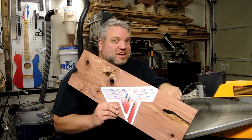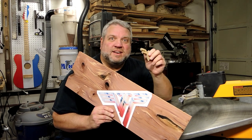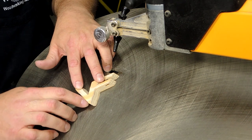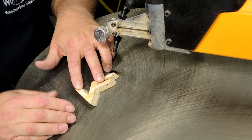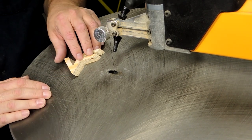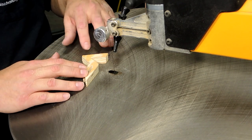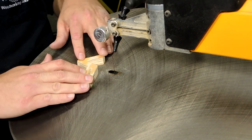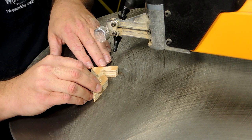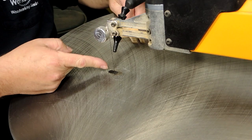After pondering this a while I think I figured out how I'm going to cut this 3D isometric looking bevel that goes that way on the logo. It involves some scroll saw setup that I'm not that familiar with, so we'll see how this turns out. I did a test piece — let's zoom in. Here's my test piece and you can see it's cut at an angle on all sides to get that 3D look. To achieve that I just tilted my scroll saw table to 20 degrees. Now to make sure that angle goes in the right direction all over the logo I need to be careful not to spin the work piece while cutting, so the only way on a scroll saw to cut something without spinning the work piece around is to use the dreaded spiral blade.